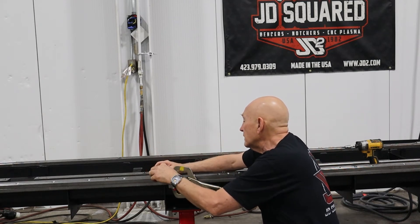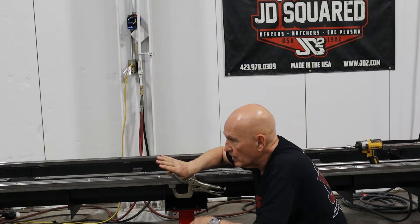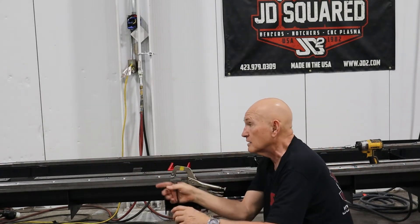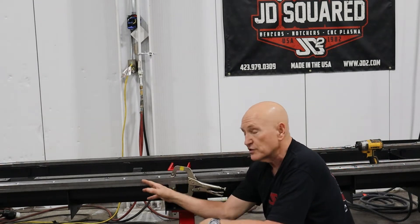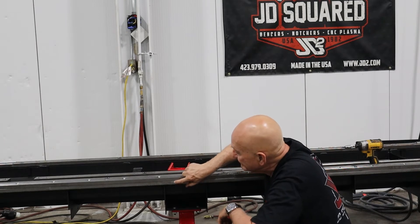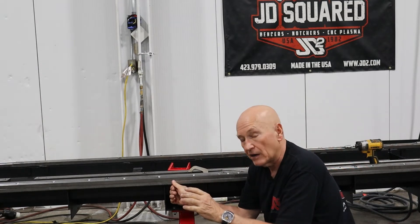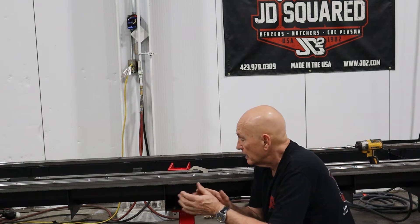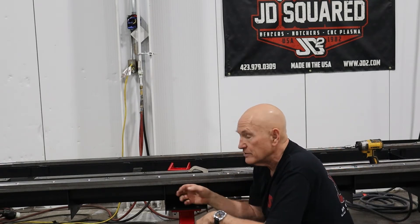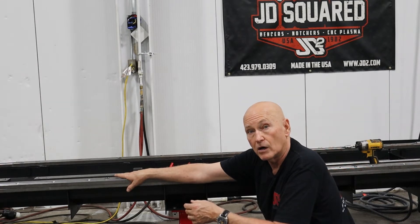Now I just need to tighten down the button heads. I'll run down and tighten all of them — there are about 13 or 14 on this rack alone. It's very important that after installation, when the gear segment is removed and everything is locked down, you want a little bit of daylight between the two gear racks — you don't want them touching. Here at the factory we mill away the flat parts so that daylight will be there. If there's no daylight, your mesh may not be correct — just hit it with a grinder if needed.